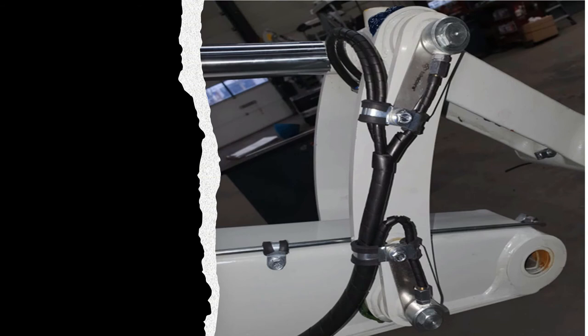Some really nice features in this installation: brackets and heavy-duty banjo fittings. A bracket is sandwiched between the banjo fitting and the parallel link, allowing the secondary lines to be routed in and around the parallel link without doing any modification to the machine whatsoever, keeping the installation looking very neat and tidy. The heavy-duty banjo fitting features a shear boss that fits into a pilot hole in the parallel link.